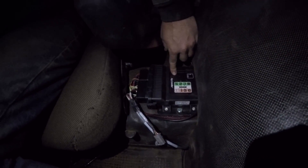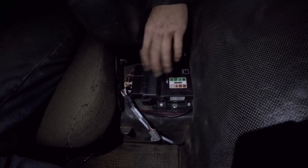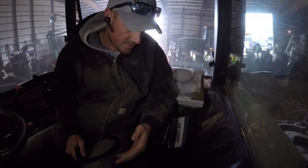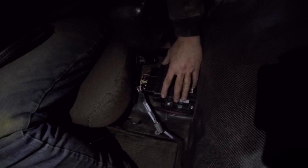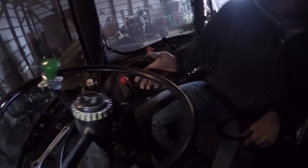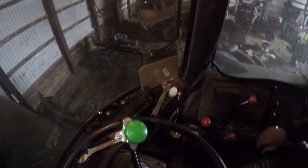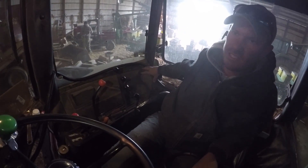We've got our control computer mounted right over the fender here next to the seat. This has a six-axis gyro in it. This is the Autotrack 3 system — it's a step up from the Autotrack 2 because it's a six-axis instead of just a four-axis system. So it's going to get roll, yaw, and pitch. It's basically a leveling device, and this is going to tell our monitor if we're on a side hill or not. Rather than the monitor and that globe just guessing accuracy and thinking we're level all the time, you can get off a little bit if you don't have some sort of a tilt module or gyro system like we have here in our steering controller. This steering controller is connected to the display cable. I try to minimize how many cables are on the floor of the cab, and in visible areas we're going to tuck most of these cables away behind the seat.